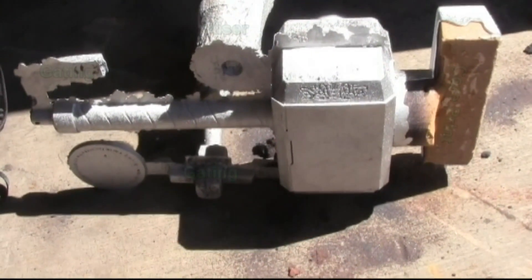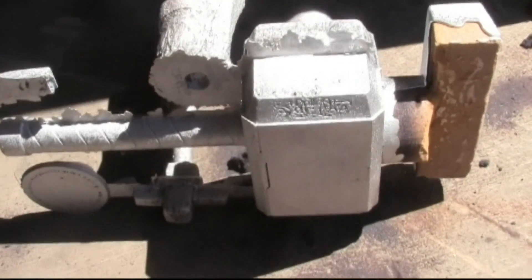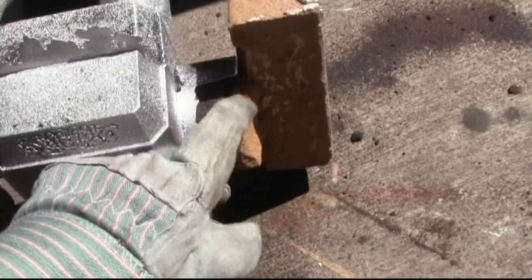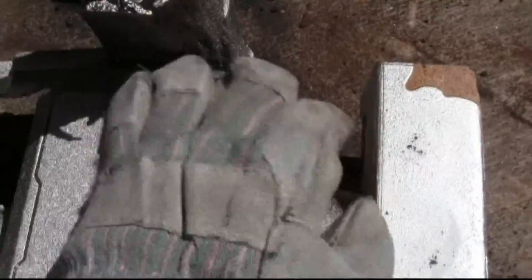Here's the finished product. After about three weeks from when I started on this design, I now have a finished part. It's still a little hot, so I can't grab it or move it around too much. I can't knock the core out yet because the sand has to cool down to temperature before it'll be able to shake out. Looks like all the engravings picked up pretty well. The difference between green sand and air-set molding is that air-set can hold a much better definition of smaller engravings because the sand is bonded with a chemical, instead of green sand where it's bonded by clay and water. I don't know if when these parts are cast in green sand they'll have as good a definition in the engravings.